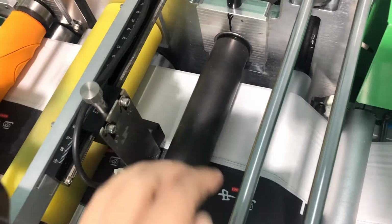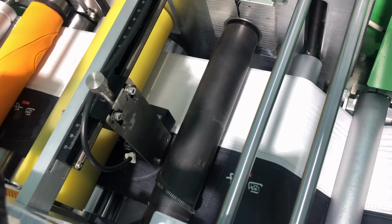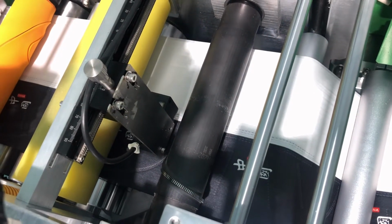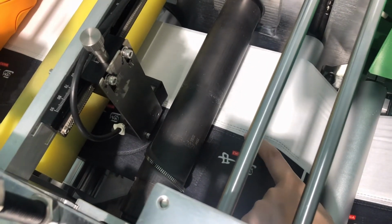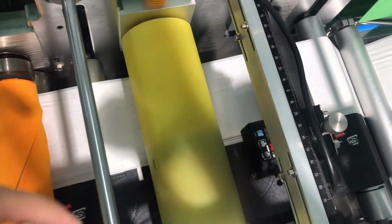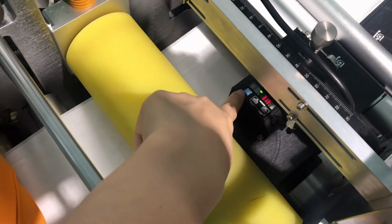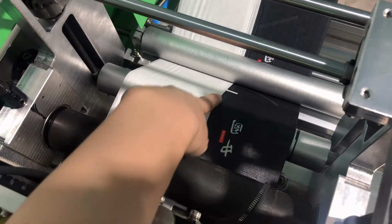And next we can see this is our second. This is for edge sealing. It uses an ultrasonic with 15K 2600 watt as well. It's meant to seal the fabric together. And we can see here it has another sensor. It's the same function as the one there. So it's to detect the fabric dot, this point as well.